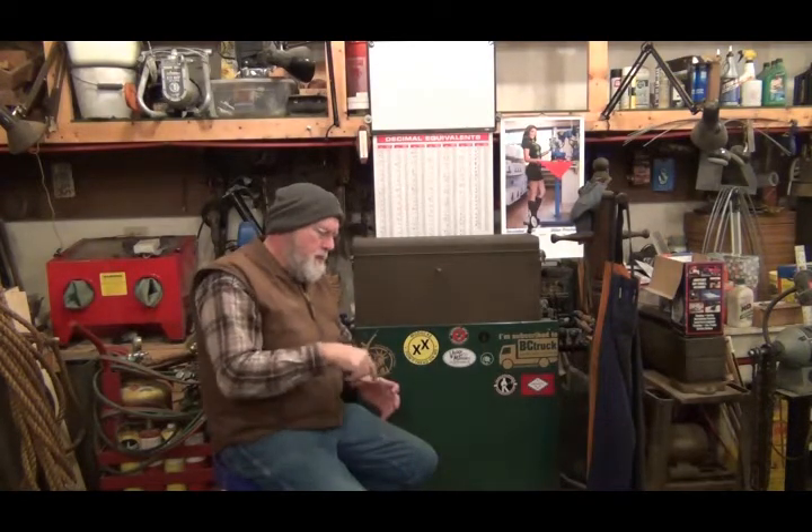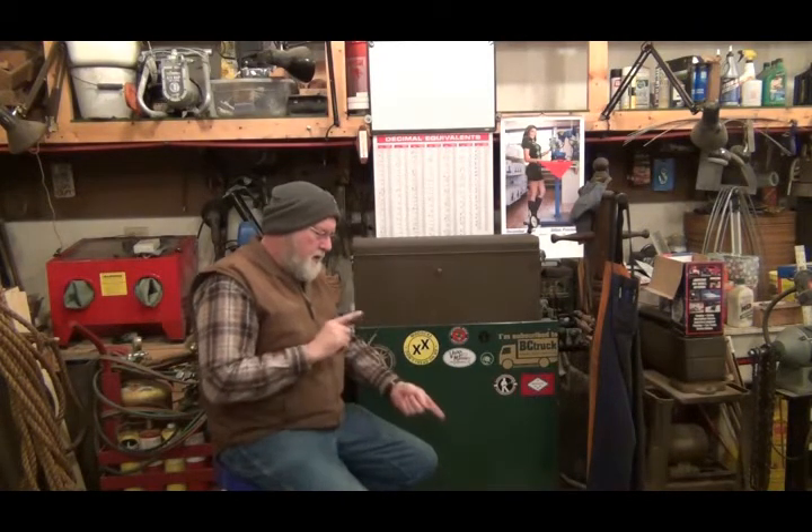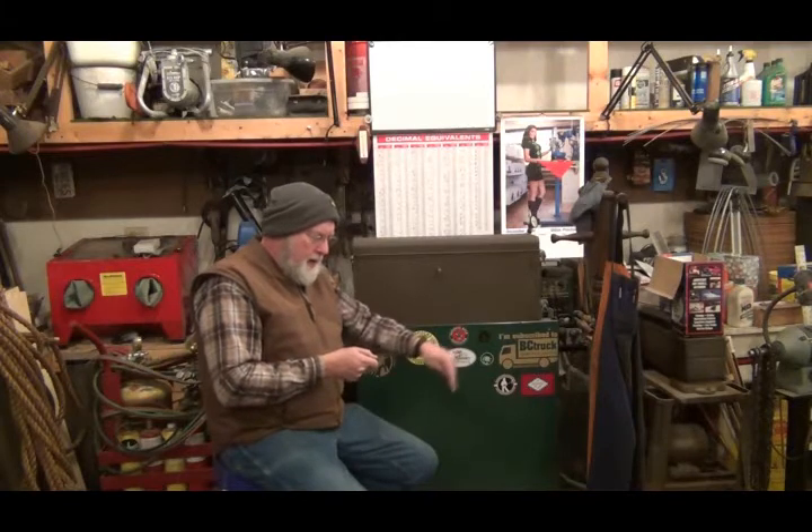So you try to catch them with a magnet so they don't fall through. Sometimes we burn little tiny parts and the head of the plasma machine is only so big around — you just can't get one of those magnets on it and it's going to fall through. So I want to make a little handled tool with one of these magnets on it, so as it comes around you can stick that magnet on it and pull that part out before it falls through the table. I also want to make another one with a handle about 3 to 3.5 feet long — the table is 30 inches high so about 4 feet would be handy — so in case something does fall through, you can reach down in there, stick a magnet on it, and pull it back out.